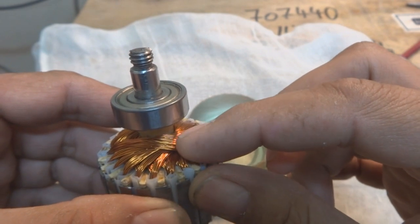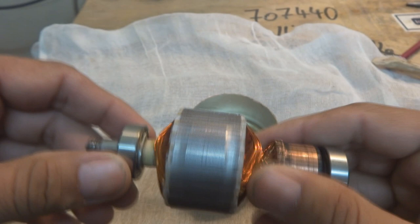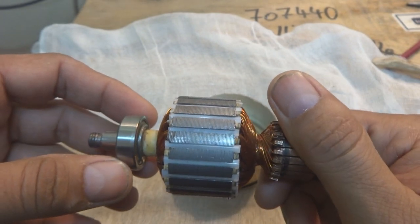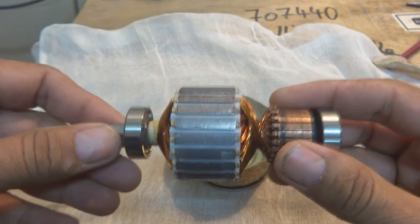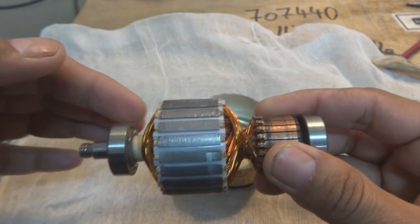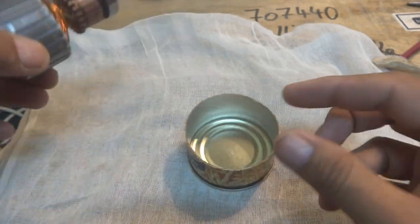As you can see, these windings are loose and you can wiggle them very easily. These wedges can also come off while rotating at very high RPM — something like 6,000 to 12,000 RPM. These windings can come off and come apart, which will be a very bad situation.